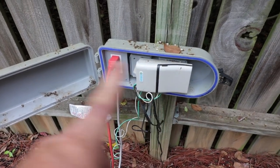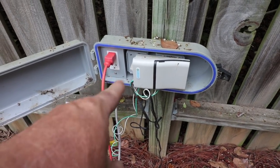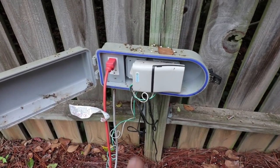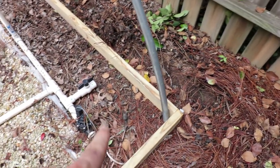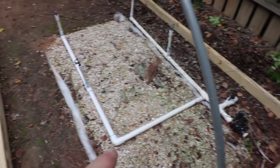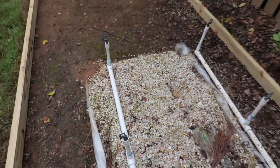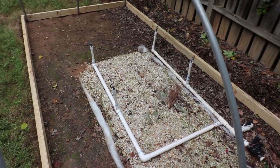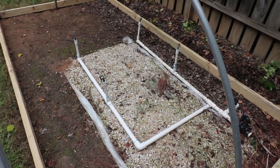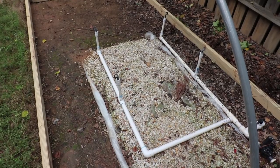Here's a close-up of the clock. This is a box I found cheap last year — I wired a little electrical outlet so I can plug my tools in there, and the clock is wired over to this valve. This is the irrigation from last year wired back to the clock with misters on it. In this larger footprint I'm going to need more of those, so next video I'll be redoing the irrigation for the inside. They need to be spaced about 30 inches apart.